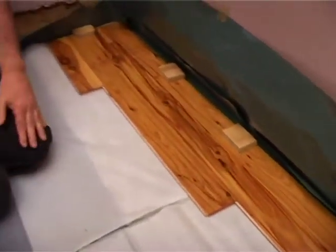If you're working with a set length floor and you have a set room, it's exactly one length. If your offcut is your starter and your offcut is your starter, you're starting to create a pattern. This needs to be discussed with the owner if you're going to create that pattern, because otherwise you may have a floor that's going to reject it. You need to create a staggered floor. And this you can achieve by playing with your starters and then creating that stagger.